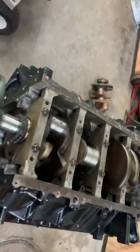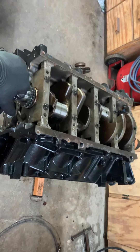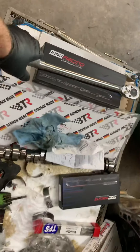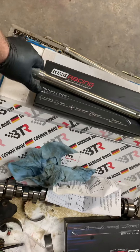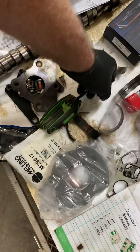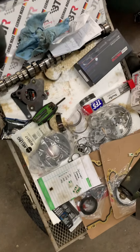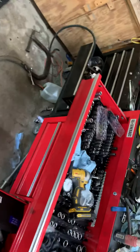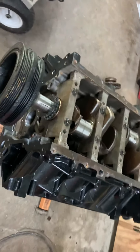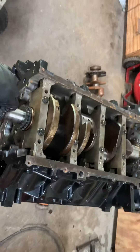Finally I put this thing in and it still spins over very nice. Next will be the rods. These are actually rod bearings, and these were the mains. These are the extra spares I've got — I need to clean this up from mixing and matching them. These are what's left over from the standard size ones. I still had to use the relief ones on the first two to get where I needed to be. I'm pretty happy where it's at now — moving on to the rods.